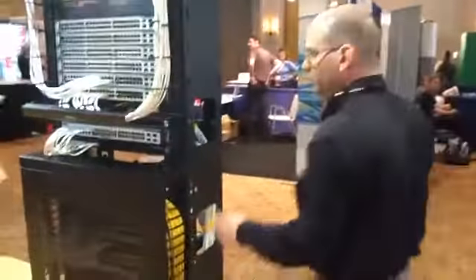Coming this way, we have our new deep relay rack. The deep relay rack is perfect for applications where you are space-constrained and don't have room for large vertical organizers that normally hang off the side. It has cable management that clips onto the side, and we also have gates that clip in to allow cables to be managed on the inside or outside. At the back you can see waterfall features on the top for the cables, and also many mounting points for your ladder rack and cable tray. Coming to the front, we also have a security closure available for this rack specifically, which is higher capacity with more airflow. It has double-hinging doors, allowing you to secure your network in those applications where you don't have a lot of space.